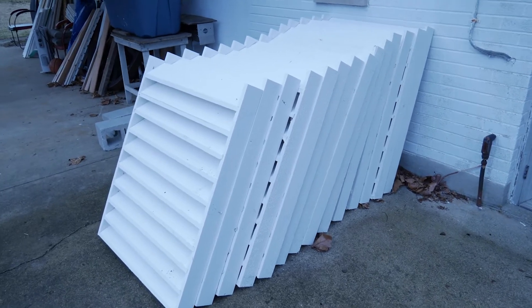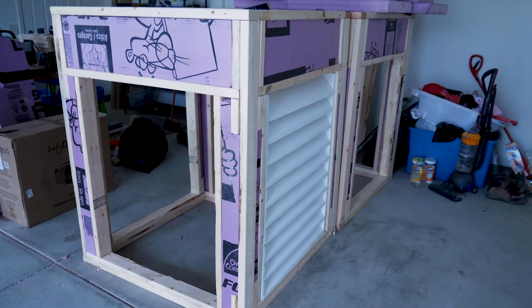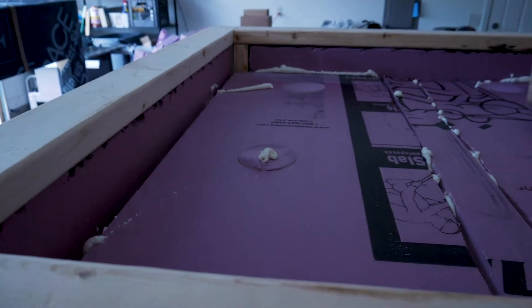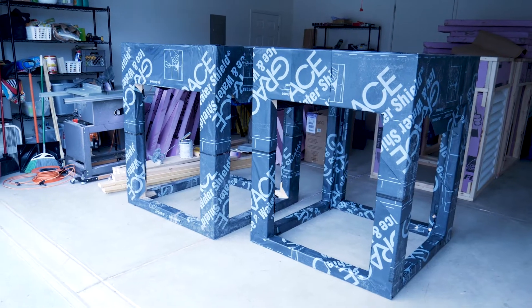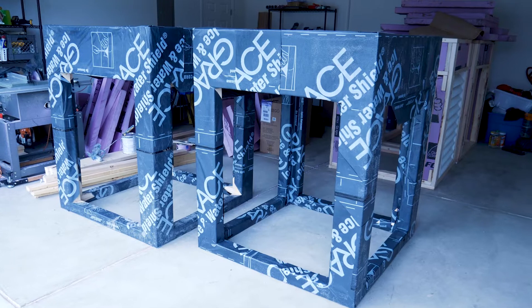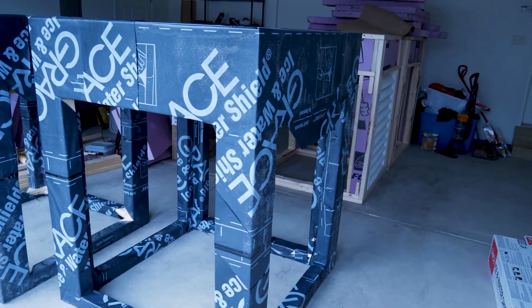At that point we just need to build the bodies to hold them. Here's one of the frames for the middle of the cupola with a louver conveniently sitting inside it. These have two layers of R15 XPS on the top and one on the side — so it's R30 roof and R15 walls, which is in compliance with the rest of the building. Then we coated the entire bodies with Grace Ice and Water Shield building wrap, which is the cure-all for problem roofing areas — also the most expensive building wrap you can possibly buy. That pretty much covers building the bodies that hold the louvers for the cupolas.